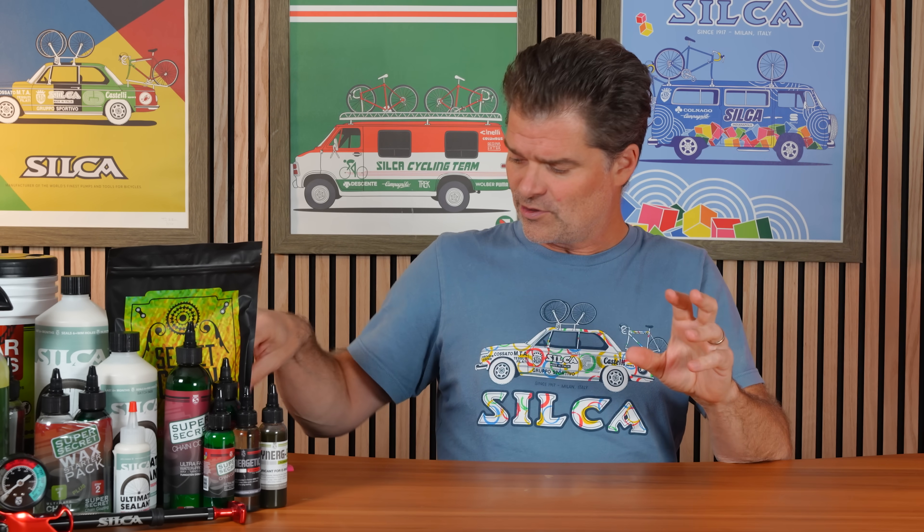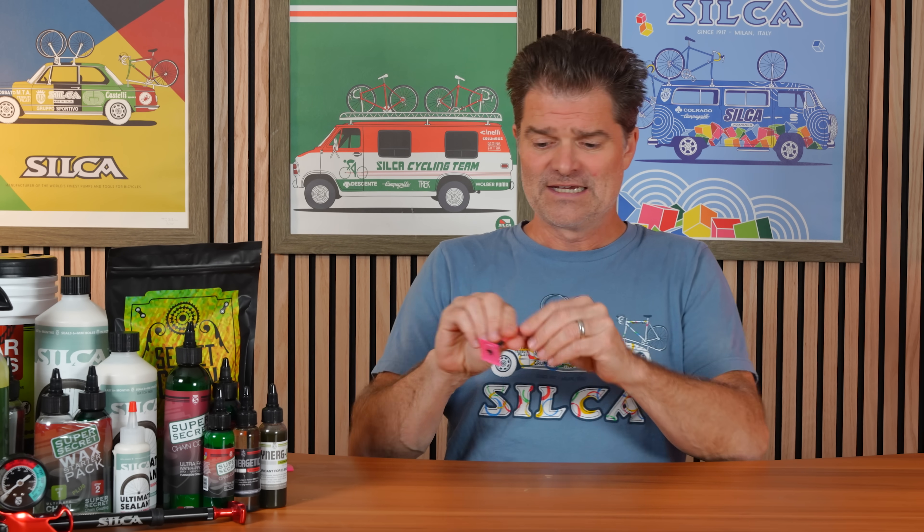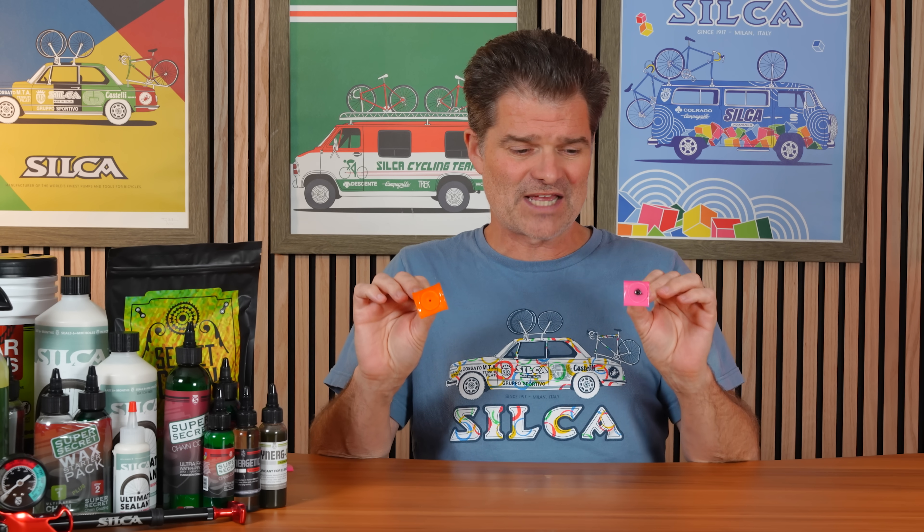We got into doing some research and realized that one of the problems is that all of these guys are adding dye to the TPU. Adding dye to plastics does some weird things — the dyes actually can reduce the peak elongation, ultimate tensile strength, and yield strength of the material. Kind of like we say with lubricants: pink and orange are not structural additives to these materials. At like 1% to get these bright, vivid colors, you're just reducing properties in the material.